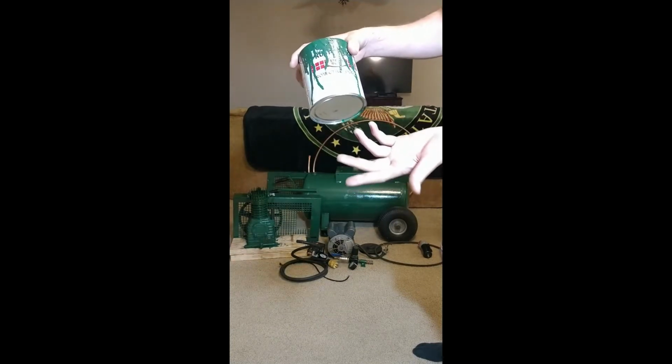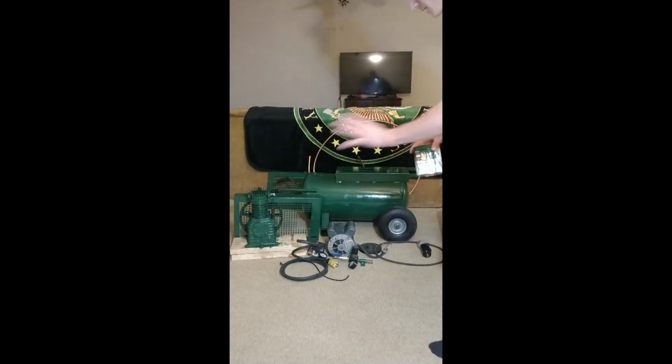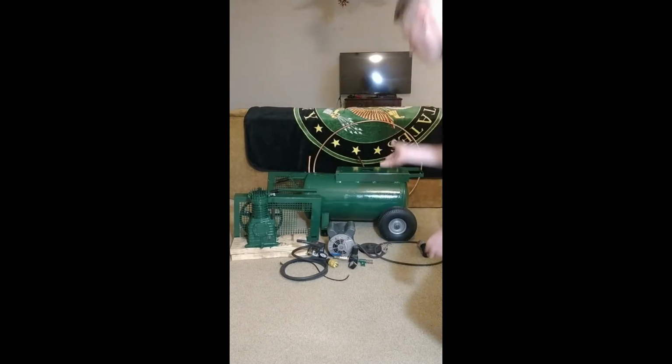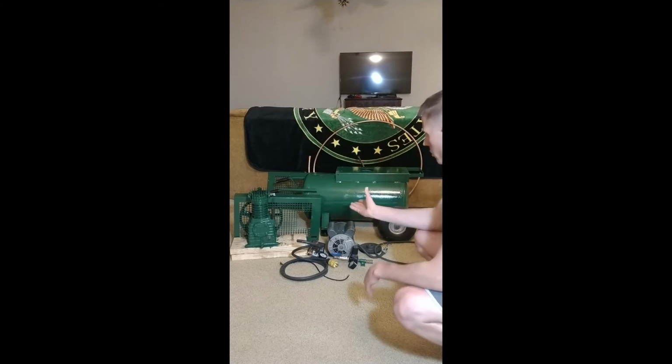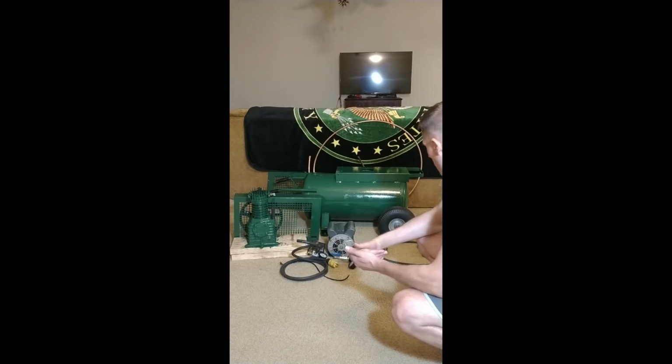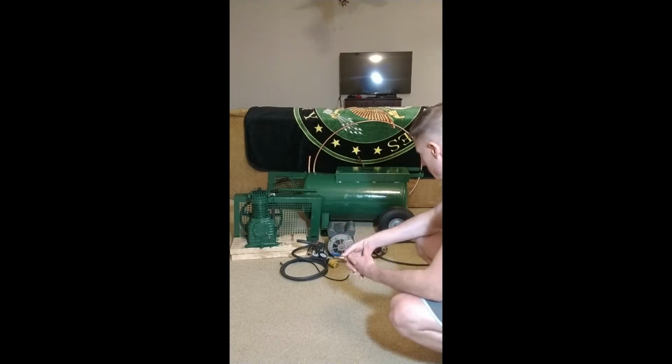It was like 12 bucks for the quart. I cleaned everything up nice with sandpaper, and then took a sanding wheel with the drill to it, and cleaned it up, degreased it, and then painted it. You already saw the inside of the tank with the borescope, so it's okay. It's got 2 coats of the POR 15 on it, so pretty happy with that. So we'll get this thing assembled.